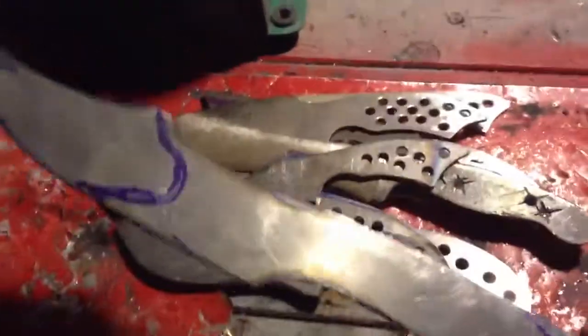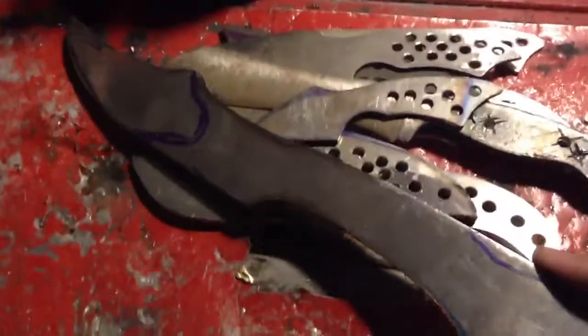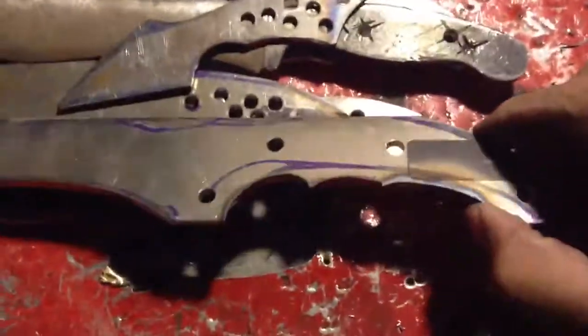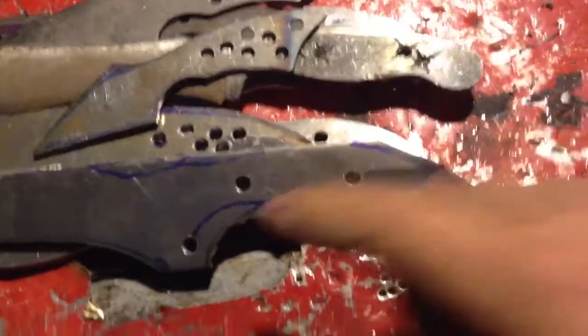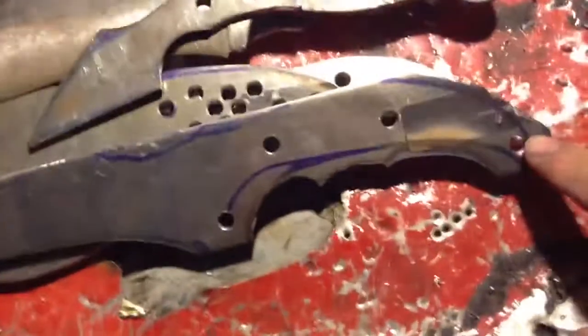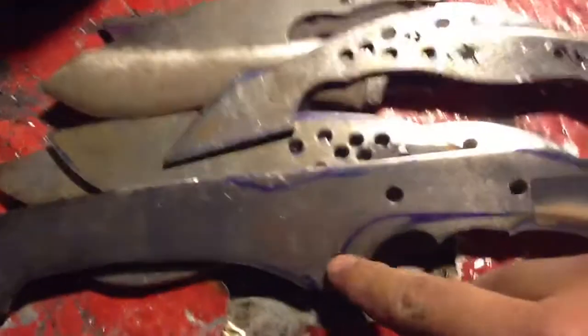The big one I worked on today is my take on a Spartan chopper or Spartan knife. Very, very big — it's got my handle shape for the most part, but then it's going to have curl overs, you know, the guard coming out from both sides. That's what these two holes are for, to stabilize that once I put the handle material on. It's going to come up here as a bolster, then one different color in the middle, and this one's going to come out into a horn on each side. Still gotta do the thumb ramp, as you can see — there's a lot of work on that one.